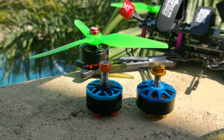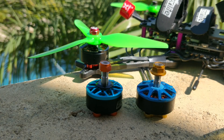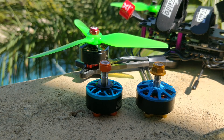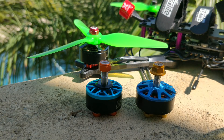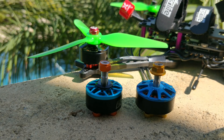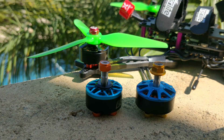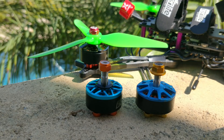Now, it doesn't just mean 6S is less torque — that's the blasphemous part I'm presenting here. But I'm pretty confident now that 6S is actually less torque, not more torque. I know a lot of people will say their 6S quad is super powerful, but you're not feeling torque — you're feeling an advantage in battery performance. On 4S, we were pulling tons of amps and didn't have enough voltage. On 6S, we have enough voltage and aren't pulling as many amps. So the battery is more balanced, dishing out power in a more balanced voltage-to-amperage fashion. Battery performance is not equal to torque.